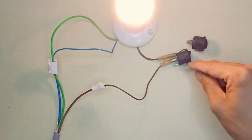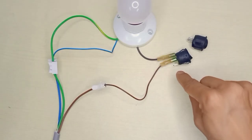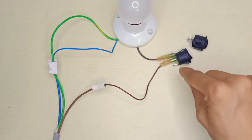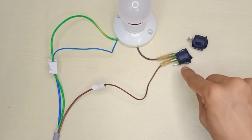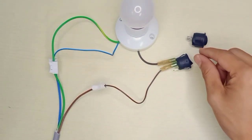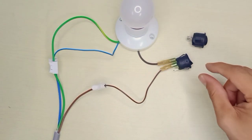But you must be very careful if you use the 3-pin switch for one appliance — once you turn off, this unused side pin now has current and voltage on it. You must tape it or cover it up, otherwise that pin still has voltage. You must not touch this pin anymore because this is a tripping type switch — this is not really safe.